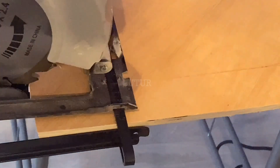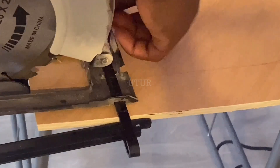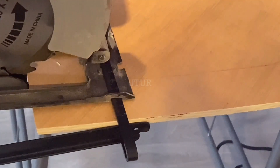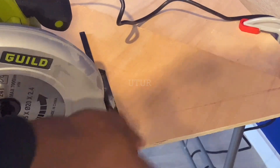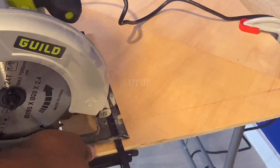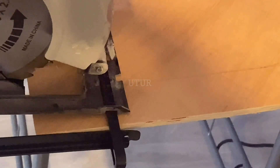The cutting line has been marked onto the plywood as an extra pair of eyes to enable a more accurate cut when using the ripping fence or parallel guide. For linear cuts, deploy the use of a circular saw, and for non-linear cuts, deploy the use of a jigsaw. This 24-tooth blade is better suited for ripping applications in natural wood. A special-purpose designated blade, or a combination blade, will be better suited for cutting plywood, as plywood is a man-made wood.